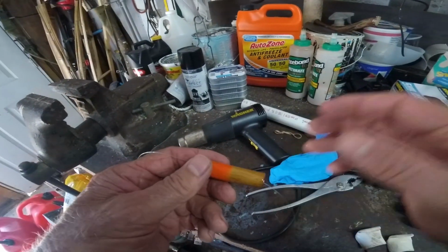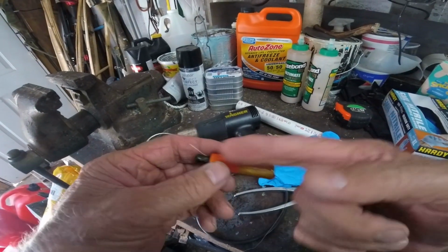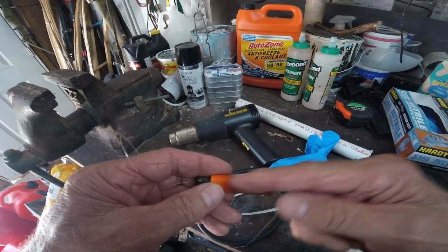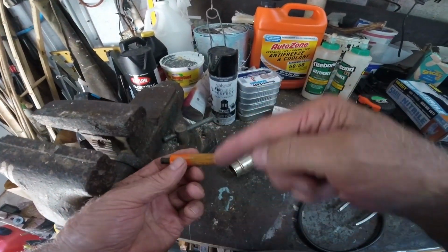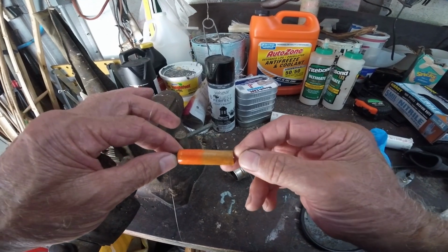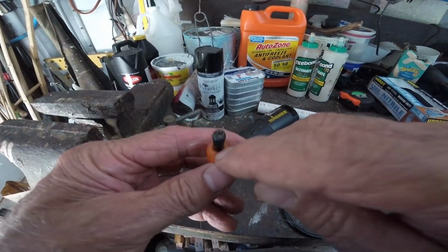Now, to turn this down, I've got a little all-thread rod. It's a really small brass rod that I stick through here, through this piece. This is square. Now I'm going to turn it cylindrical. Run that rod through, and I've got enough rod to stick it in my drill motor. You want to put the drill motor on reverse, not forward, because the nuts will come undone, because you're going to slide this down and then tighten up these nuts. I've got little washers too on each end that are smaller than this.